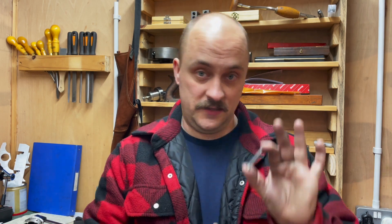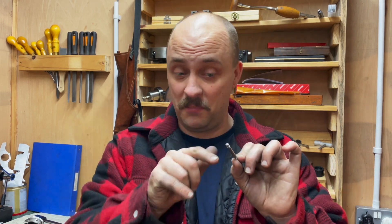Thank you for joining me on this short adventure of spring pins and nuts. Certainly, as I'm making these - even as I'm making the videos about making them - I'm learning shortcuts and areas I can improve on. I'm using different combinations of tools. For this particular piece, the one that was missing, I had the whole bar chucked up and I used two sets of Jenny calipers to get the various points, faced the end, then got the measurement for the gully and plunged in there.